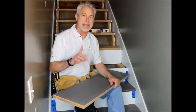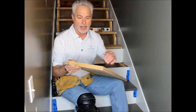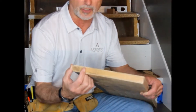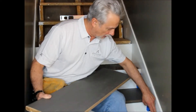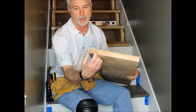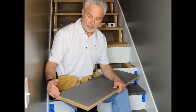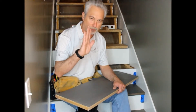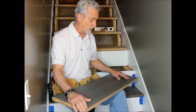We're back here on the steps. I want to make mention again: when you're cutting the stair and adding that extra angle, you always want to make sure you stop before you get to the stair-nosing or bull-nosing portion of the tread, because that's going to be exposed. When you look at these treads, you want to feel a solid bull-nosing portion. I also used my belt sander along the ends to sand it perfectly to the scribe I made. Assuming the stair jig was used correctly, everything should fit in here just like a glove.